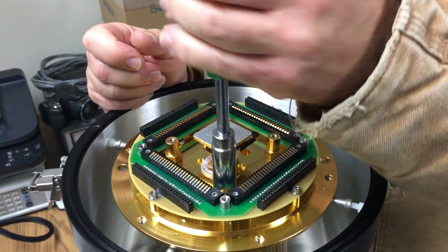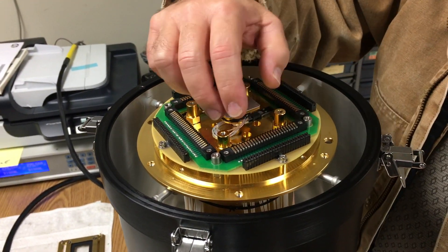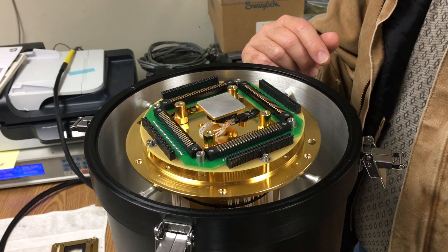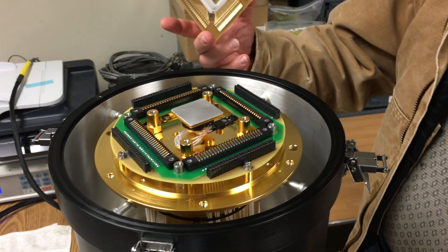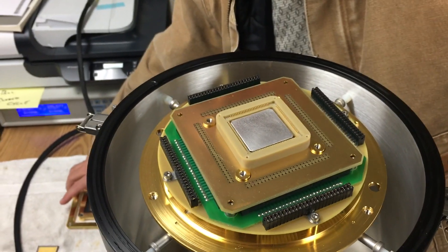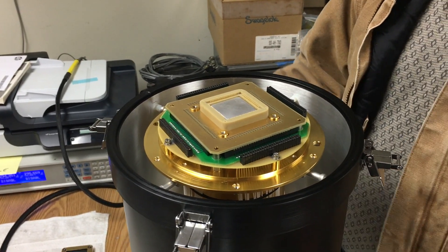Some people put a layer of indium underneath this pedestal between your cold plate and pedestal as an interface for testing. I don't, and I don't usually ship it out that way either — that's your choice. Once you've got the pedestal in, this is one of the boards we manufacture — it just goes on over those posts. There's no orientation for that either. If you want to pick a pin one, you might want to mark your board so you always know which way pin one is.